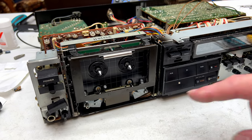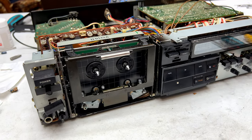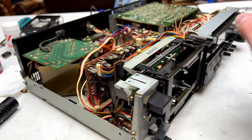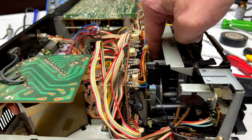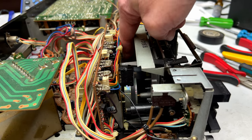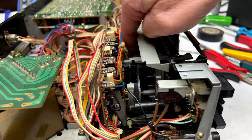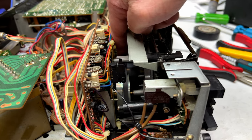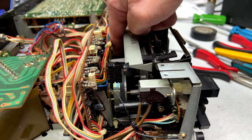I did find a piece of capacitor lead inside the FG coil where it shouldn't have been, so I pulled that out. Hasn't changed a dang thing. It does feel like there is some type of action going on in there when I turn it on. It feels like there's some kind of magnetic force in there that I don't feel when it's turned off, like right now. And I think I've seen that thing twitch a little bit, but it's powered up right now, and yeah, I can feel it acting on the flywheels, but I can't get the dang thing to actually start, so I don't know what's going on with it.